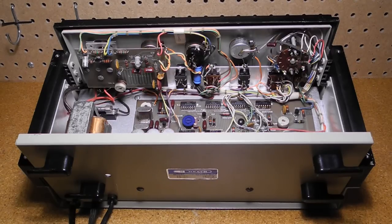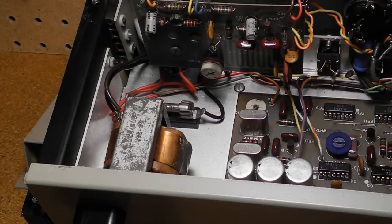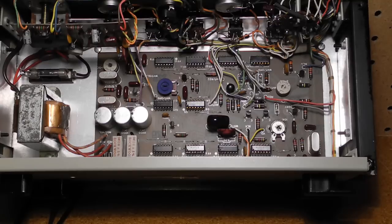Taking a look inside, most circuitry is on two printed circuit boards with additional point-to-point wiring to the front panel, mostly using a couple of pre-assembled wiring harnesses. The power transformer and fuse are on the chassis. The power transformer is described as a special copper-banded low-flux leakage unit to prevent stray magnetic fields from disrupting the receiver under test. The main circuit board has most of the timing circuitry, including three crystal-controlled oscillators, and there are several trim pots and caps which need to be adjusted during calibration of the unit.